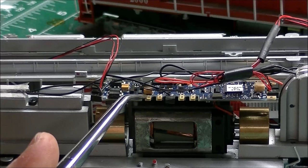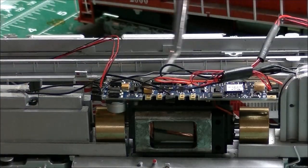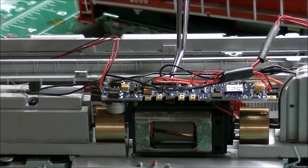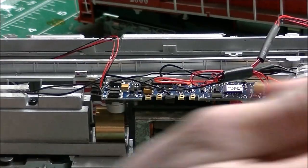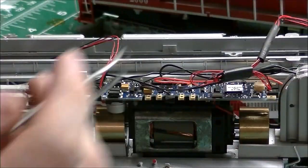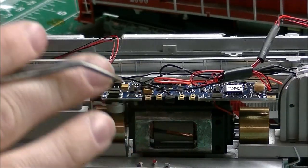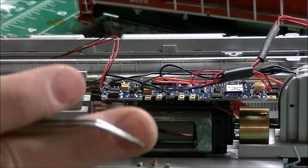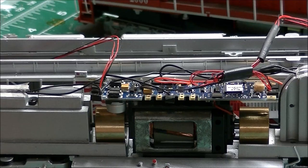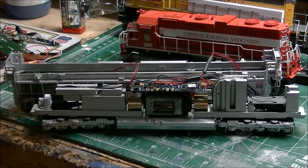You've got your volt common, then functions F6, F5, F4, F3, then F7 and F8. On the back side you've got motor positive and negative, then speaker positive and negative. They have a 28mm one-inch round speaker held in by two screws. I put a gasket on it — if you're tired of the sound vibrating you can either add a gasket or turn down the volume. The master volume was three-quarters of the way up, so I went back and changed some CV volume values to turn the locomotive down so it wouldn't be extremely loud.